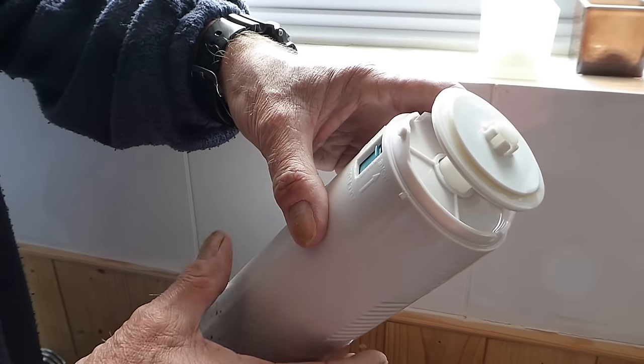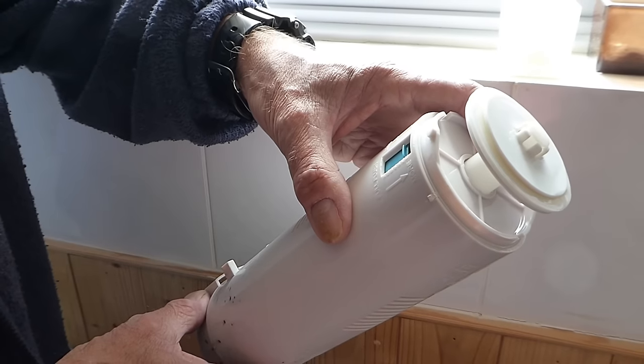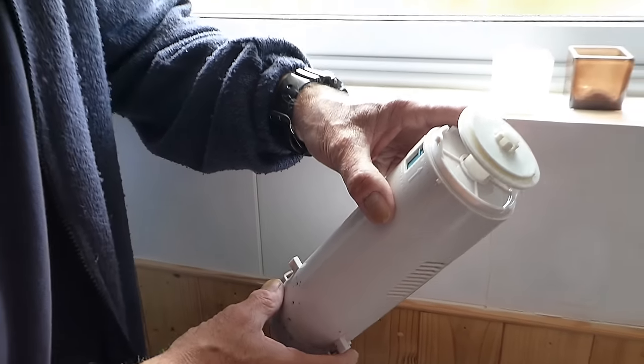Some of those don't always pull out like that. If you've got one that doesn't twist and pull out, then you've got to take the whole system off the wall and change the whole unit — I know it's a bit of a nightmare. I've got a video on how to do that. But this washer is generally the culprit, and nine times out of ten it's this or the ball cock.